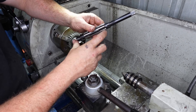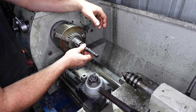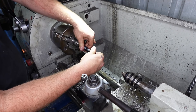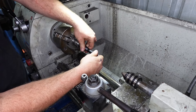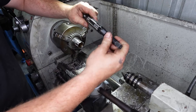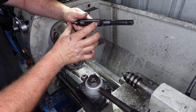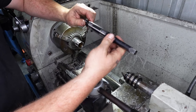At the moment I've got this adjusted all the way small, so it'll just go through and work like that — it just touches. So what I'm going to do, I'm going to put some oil in there and I'm going to turn this until it's just nice and gets loose again. Then we're going to check it with our main shaft and then just keep turning this up a little bit at a time, putting this through until our main shaft fits nicely.